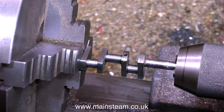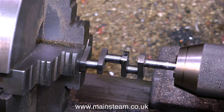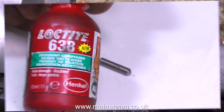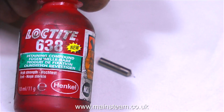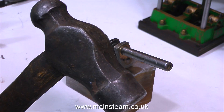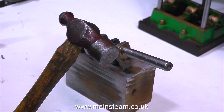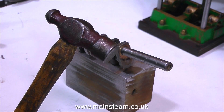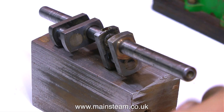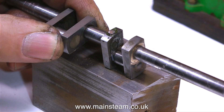This next bit is quite important. With the crankshaft firmly in the lathe, clamped at both ends so it's held in the correct position, it's essential to make sure that the peg and the hole in the crankshaft align. I'd already made a new peg, which you can see on the bench. This next part takes place after the Loctite has cured. Rather than a large hammer, it's more sensible to use a lighter weight and not put a lot of pressure on it. I'm doing this on a steel block that sits on my bench, which is very solid. Even though it looks like I'm putting a lot of pressure on the crankshaft, I'm not.